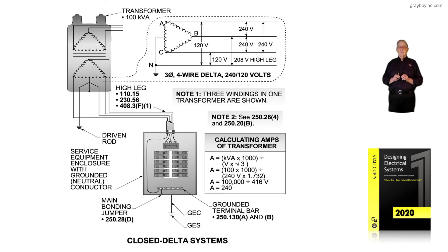If we just want the 3-phase output of this transformer — what would L1, L2, and L3 be worth connecting into the main — we would take the 100 KVA transformer, multiply by 1,000 to obtain VA giving 100,000 VA, then divide by 240 volts times the square root of 3, which equals 416. The result is 240 amps, and at decision time you would say you want a 225 amp main and protect that conductor at 225 amps, rounding down.